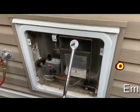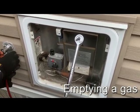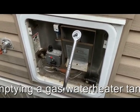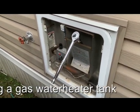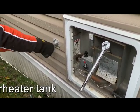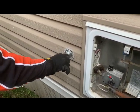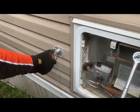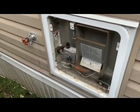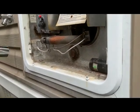Here's a Reflection park model, but it has a gas water heater. This video segment shows how to winterize and empty a gas water heater before you blow out the lines inside the trailer. Step one is to shut the water off at the main spigot — water is confirmed off. With everything closed, take a one-and-one-sixteenth inch socket and find that little knob on the bottom of the heater.